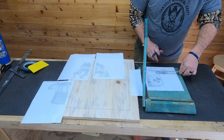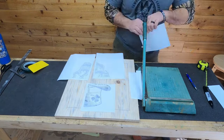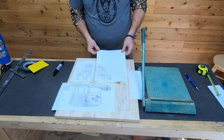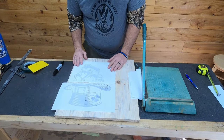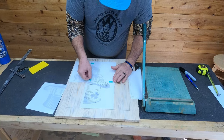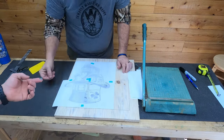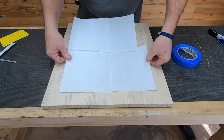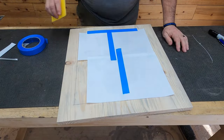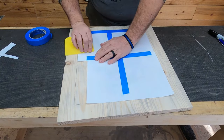For the layout on this sign we used our inkjet transfer process. That's really involved - there's several different steps and we did an entire video on just that. I'll leave a link in the description below. Basically we print it out on freezer paper, trim and tape it together, turn it over, get it centered in that square, and then rub that paper and it actually transfers onto the board. Once you get it transferred, remember to put one or two light coats of clear over it, otherwise as you're carving it could rub off.